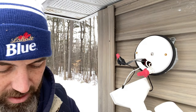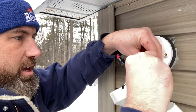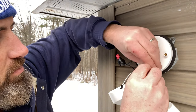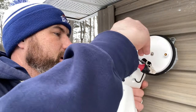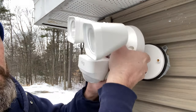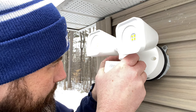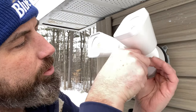Not a pretty tape job this time, but I'm slowly running out of daylight — it gets dark so early. Can't tell on the camera but it's getting dark fast. Now all we're going to do is shove these wires back in. Wires pushed back in, remove your little hook. There are two holes here and two holes on the light — that just slides on. Put in the second screw down.